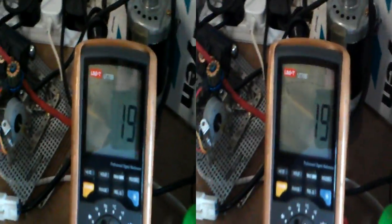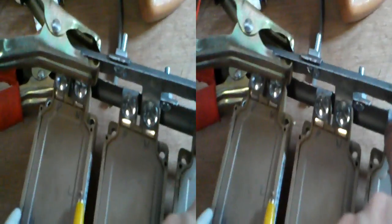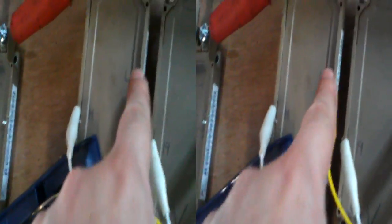I've marked the connections up so we know what they actually are, because I never marked the other ones up. So we've got P — that's the positive, which is coming off the bottom rail. And then the N, which is coming off the top rail, which is the negative. And then we've got the inputs: high side and low side — these are the three phases.